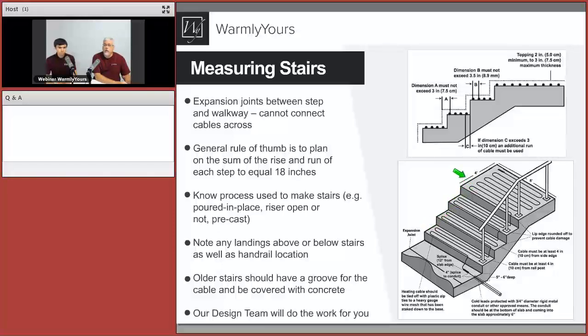The problem is, it's just like setting a brick. When you put a brick down, you don't just lay it down and say, okay, I'm done. You actually take the brick and move it in to set it into that mortar. Well, the problem, and we see this all the time, is when people are putting limestone caps on, right here.